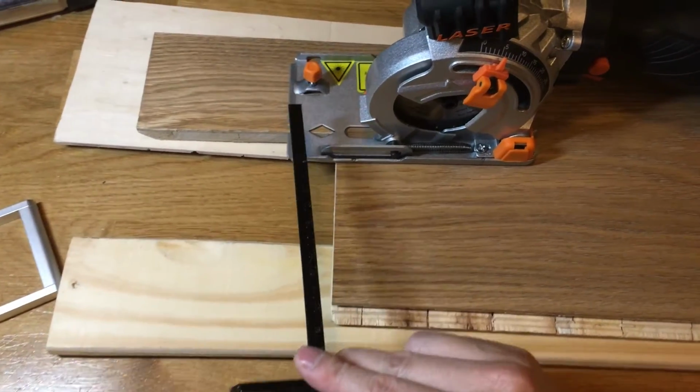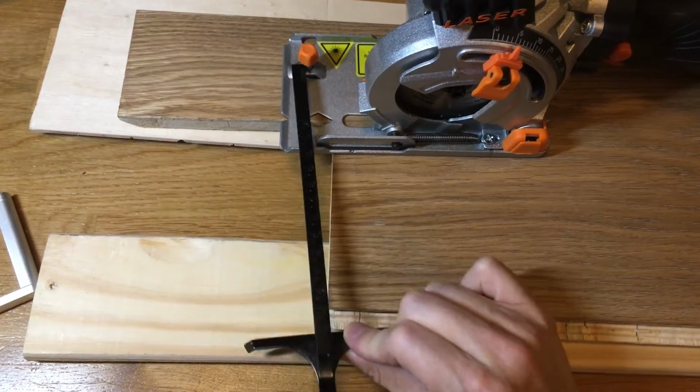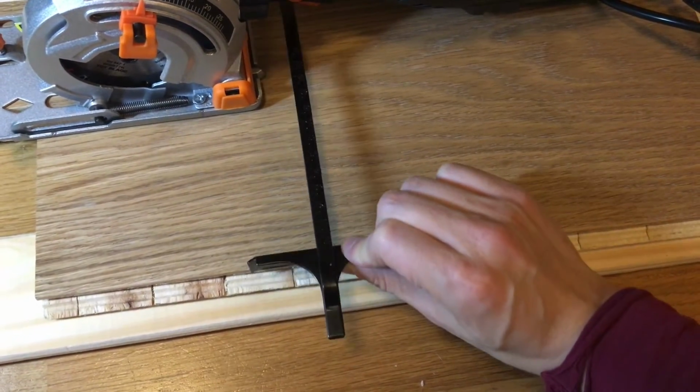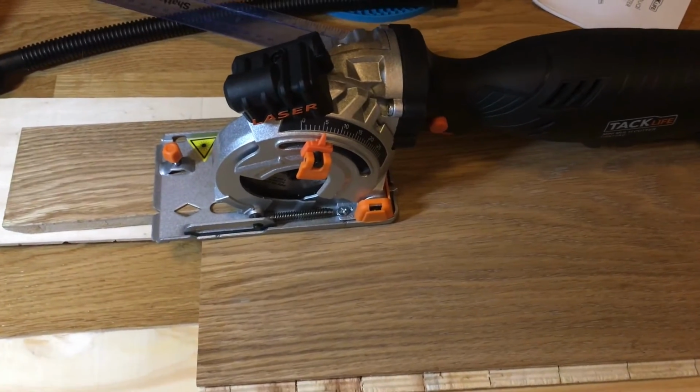We have a guide rail as well, for if you want to cut something like this, like I did. You slit this through the holes here and lock it down, and then when you're sawing, you could have it guide along this. Keep in mind this only restricts you in this direction, but in the other direction it could just pop right off, so be careful with that.